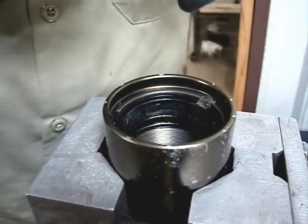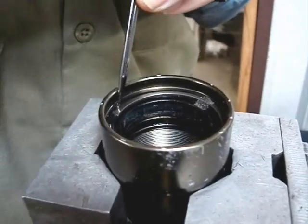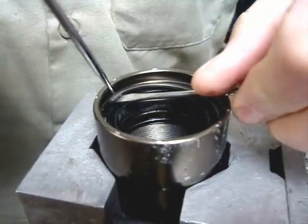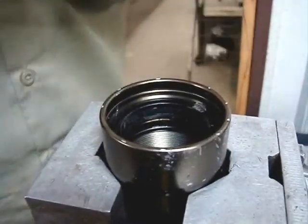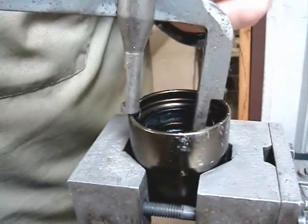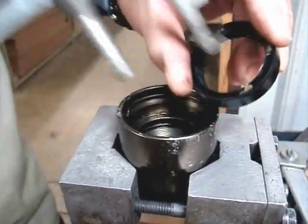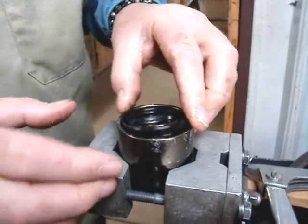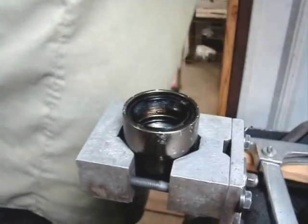To extract the seal, once you have the dust wiper off, you'll see there's a circlip there. If it's the first time you're changing the seals, it doesn't have a notch or anything — one pick to press it down and move it away from the edge, and a little screwdriver picks it up and takes it out just like that. You might find corrosion in there, so it may take some cleaning and digging around to get it loose. That's a seal extraction tool I'm using. You can get a screwdriver under the seal and pry it out, but that's potentially damaging your seal cap.